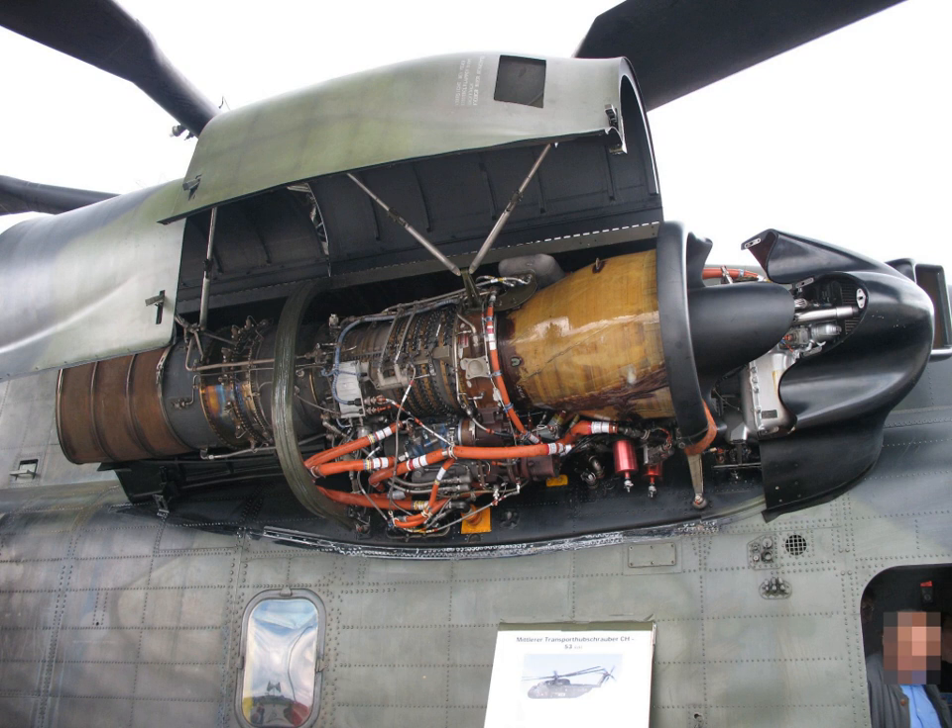The engine features a high overall pressure ratio, yielding a low specific fuel consumption for its time. Although the compressor is all-axial, like the earlier General Electric T-58, the power turbine shaft is coaxial with the HP shaft and delivers power to the front of the engine, not rearwards.